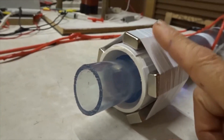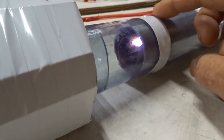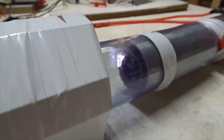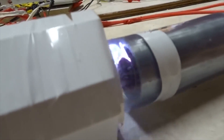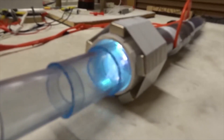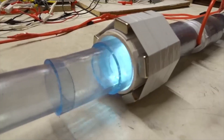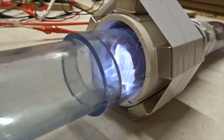As we have the radial magnets placed in front of the aluminum tube with ionized argon gas, you can see the magnetic field makes it start spinning gently, even when very close to the magnets. As we move them closer, it spins faster. When we place the ends of the aluminum tube about halfway down the radial magnets, we see a tremendous blue glow from all of the argon gas being ionized and shot out. Five works stronger than four.